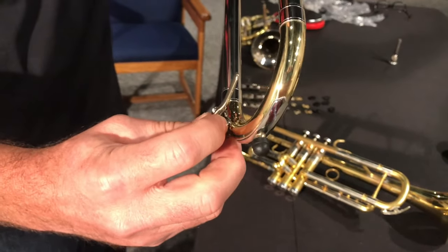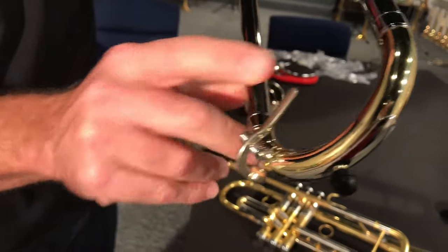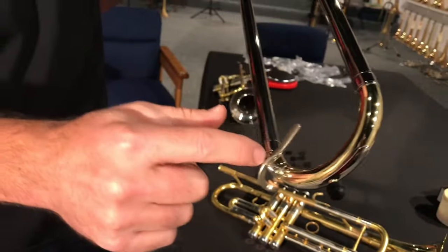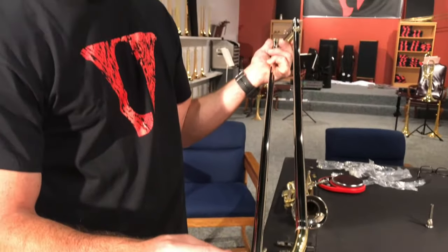Also make sure the legs aren't cut too short, because if they are, when you go all the way down it can unwind and then you only have half the spring tension left. When you get half the spring tension left, grab one of your replacement springs and have it installed at a later time. You can still survive, but you don't want those legs cut too long or too short — just right.